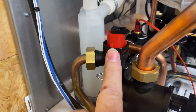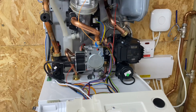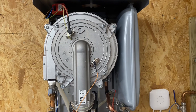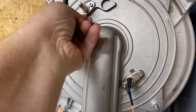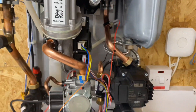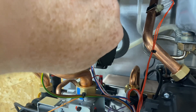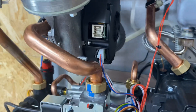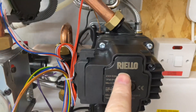The PRV is there and is easy to access. I'm going to remove this burner now — I'll take off this lid here and this one as well. We've got a plug on the fan which I'll take off, and another one here. Then we just need to disconnect the gas pipe.